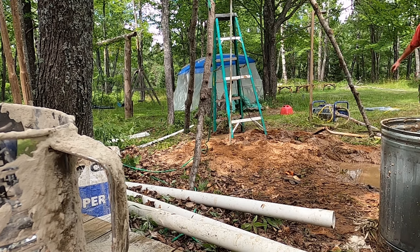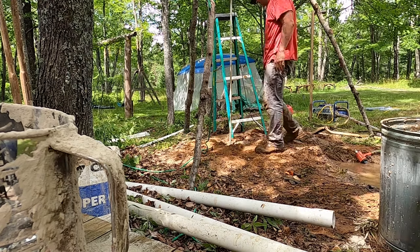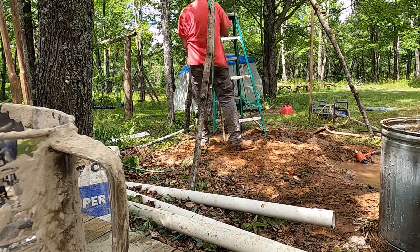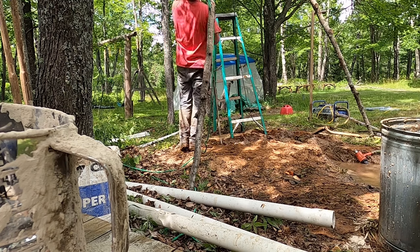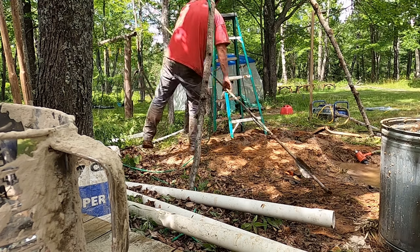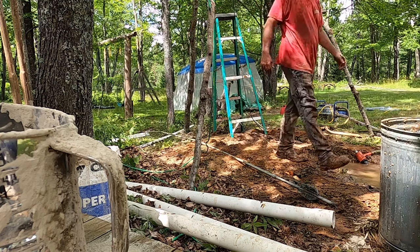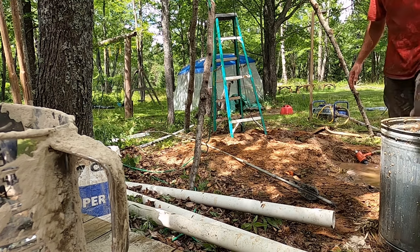So super important not to let that drill bit rest on the bottom. Something else that can happen, you can see it started to happen there. It was kind of hard for me to pull it up out of the ground, is all the debris in the drill hole can start to settle on top of your drill bit. And if too much of that settles, you've got a problem. You might not be able to get your drill pipe up out of the hole. So that never happened to me. But part of what you need to do to prevent that is, anytime you stop drilling and there's not water flowing, make sure you raise your drill pipe a bit.